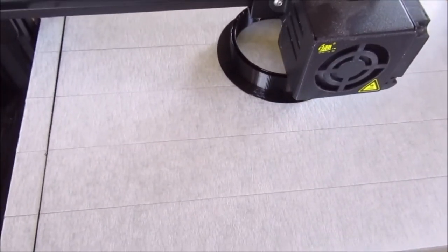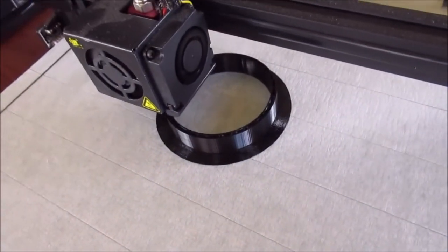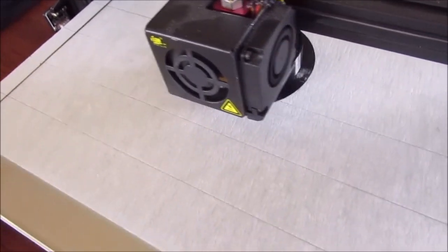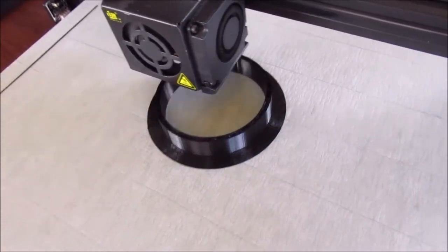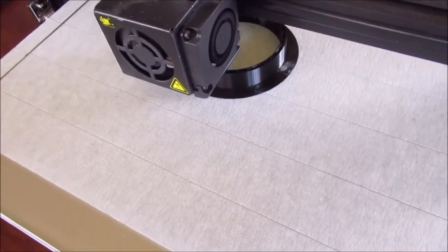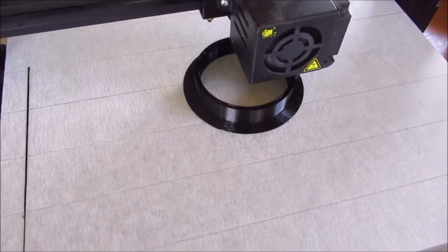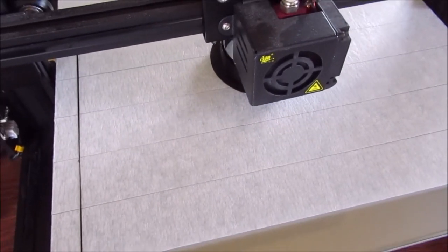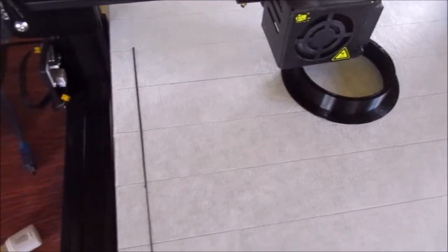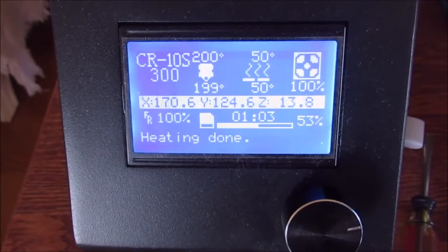This is the stator ring printing. And by the looks of it, the filament fan is on and the extruder fan is on. I put it at, I think it's 20% infill. I don't want to spend all my PLA and it's not even going to be anything else but for testing. And these are my settings for PLA.